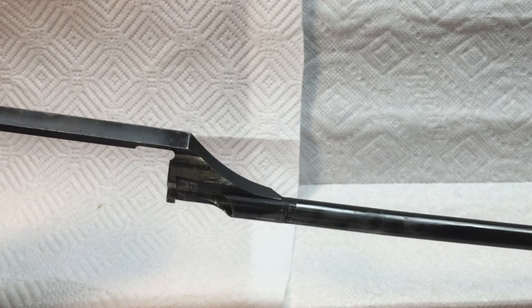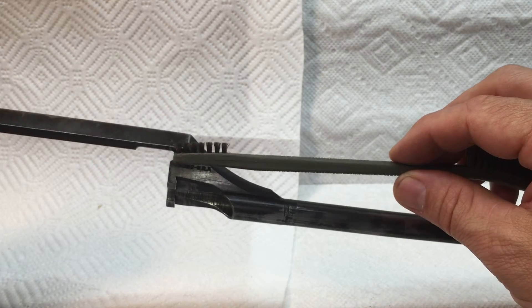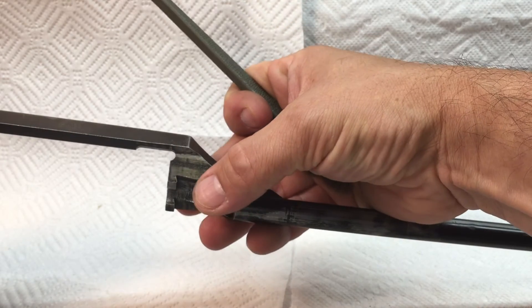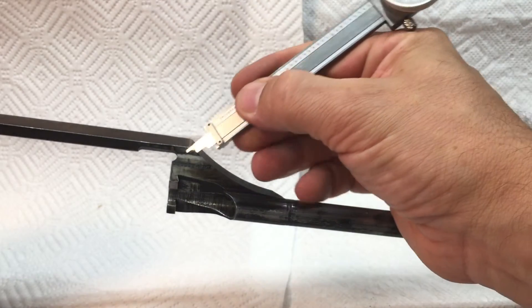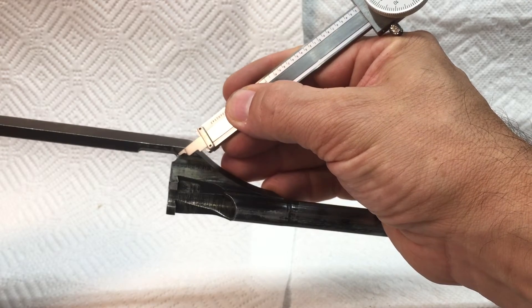This happens to be a World War II Winchester. This is called a relief cut — a modification. This semi-circular cut helped reduce stress where the arm meets the main body, so that it wouldn't crack. Post-war production ones are actually made a lot larger, and you'll see it dipping down into this area, taking more metal out.